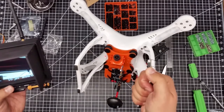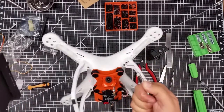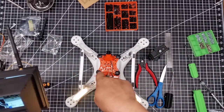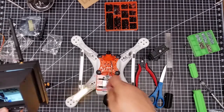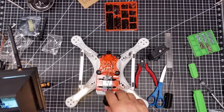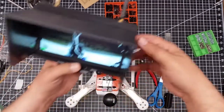If I were to get this monitor — we have a picture. You're kind of looking at yourself looking at me, my hat on backwards so I don't hit the mic stand. You can see it all works. I have this Mushroom antenna — I believe it's a 600 milliwatt transmitter. This guy gets a little bit warm, so I'm hoping with the Mushroom antenna I get some pretty good gain.